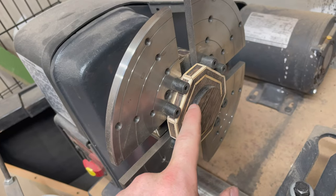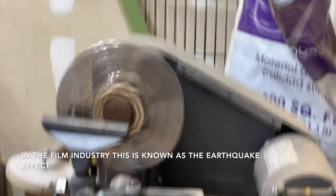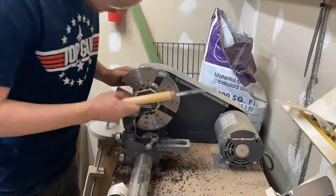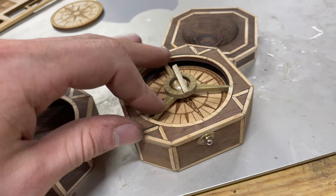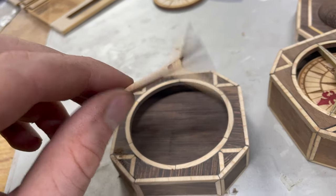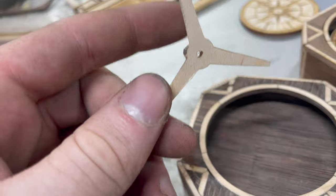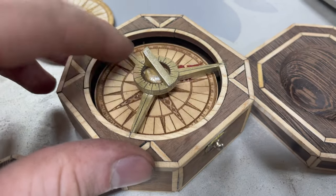Next I'm gonna stack up these three rings - we're gonna put the worst-looking one on the bottom because it won't be seen at all. I'll put this on my lathe and I'm just gonna turn down the outside into a nice little dome, then flip it over and carve a little concave area on the backside. One big thing I want to change about the old compass is that this piece is much too square - in the movie it has a bit of an angle to it. I'm gonna chamfer these edges, and now we've got chamfered edges. The inside looks a little ugly but it'll be covered up with those two dots, one on top and one on the bottom.